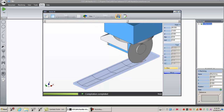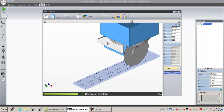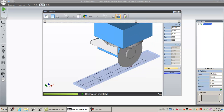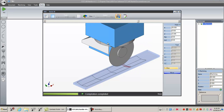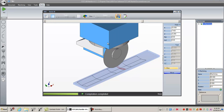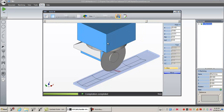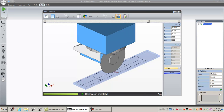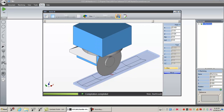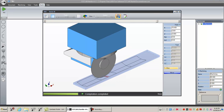48, alright, look at the distance on the X, 46.4. See, my step over was 0.4. I don't know. I really don't know what a good step over would be. I don't think, it depends on how deep the blade goes into it. So you'd have to basically calculate the chord that you would want. But I don't think many people want to sit there and figure that out. So let's start with a smaller number, like maybe 10 millimeters or something like that. About what I had. 0.393 would be 10 millimeters. So there's the brushing. So that should get rid of all the steps, the lines.